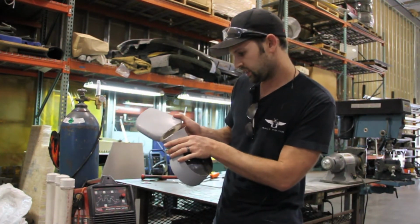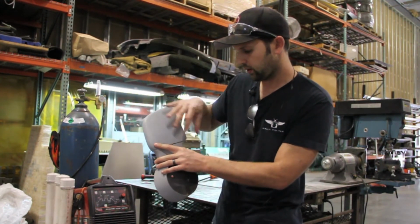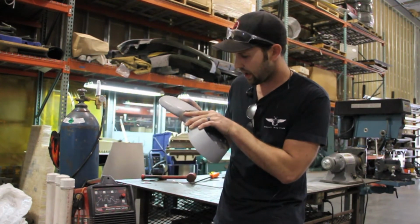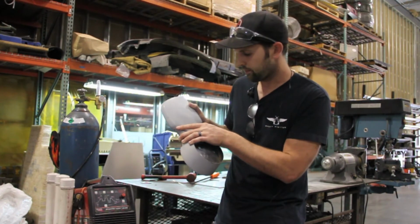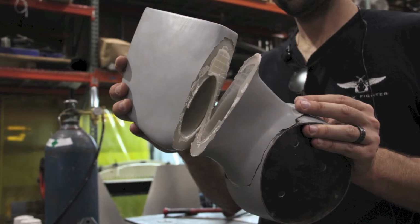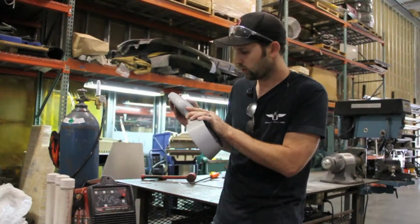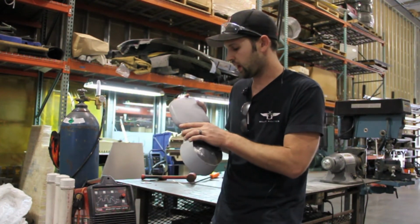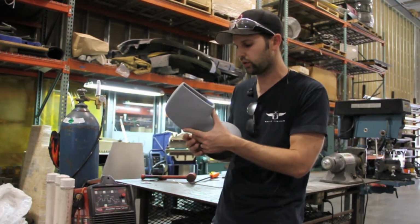We can see in there we made a slight collar to assist in the alignment of the two pieces, and that actually snapped at one point, and that probably contributed partially to that giving up. We can also see that with the distribution of Plexus, maybe applying it in different locations, we could improve the adhesion between the two, but I think we'll probably also try to add pins in the next rev to see how that helps with the durability of the overall thing.